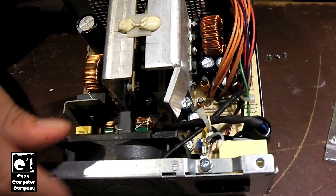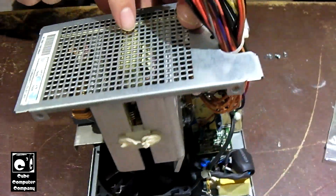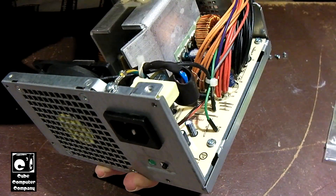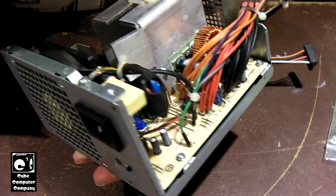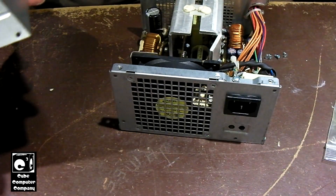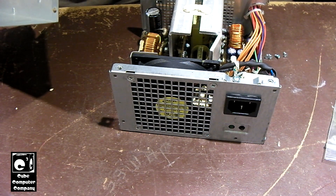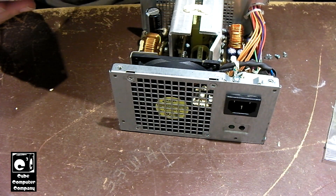We've got another X cap back here, and this big coil in our primary capacitor — 150 microfarad at 420 volts. The active PFC units usually just have one main cap in them, so it's a pretty tiny capacitor for a 265 watt unit. We've got our primary switching over here. I'm not sure exactly what topology this unit is off the top of my head. Down here is the main transformer, and we've got an auxiliary transformer beside it. I'm not sure if this unit generates 12 volts and does DC to DC conversion from 12 volts to your 5 and 3.3 volt rails.